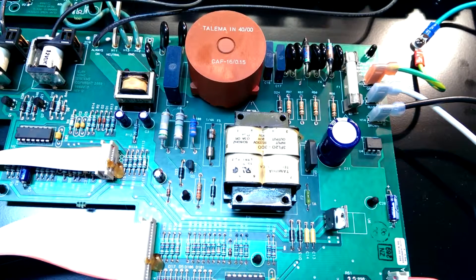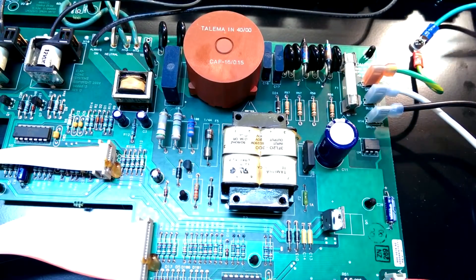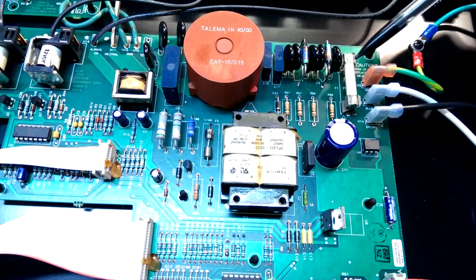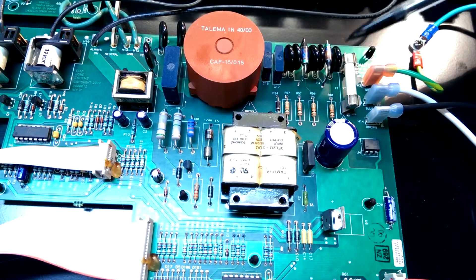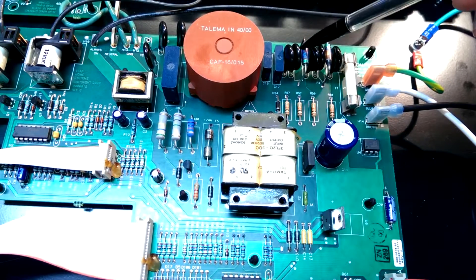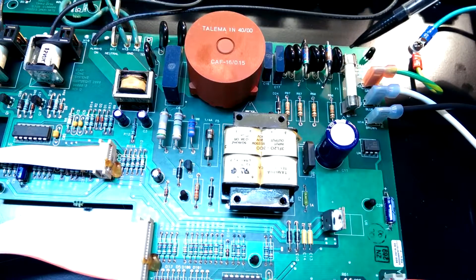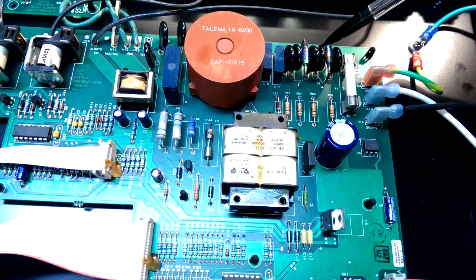Taking a closer look at the input protection, surge protection, and common mode choke section: there are three nice screw-terminal connectors on the board, which makes servicing a lot easier. There's a ceramic fuse right on the input, plus the 15-amp circuit breaker on the front. Looking at the MOV surge protection, it's actually quite nice — they have two MOVs in series between ground and neutral, and ground and hot, with a fuse in series with each one as well. This is a really smart design because MOVs wear out over time as they take surges; they can fail open or short out, and having individual fuses means you blow the local fuse rather than the main fuse.